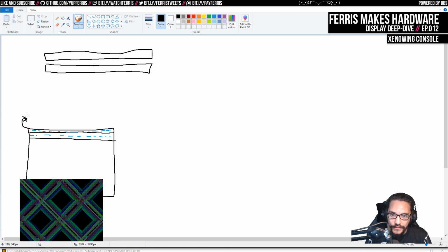And then we read data into this buffer while we start displaying out of this one. But of course, initially it doesn't display out of anything. So then when we reach here, this buffer is filled with a bunch of pixel data. And so then we're going to display out of this buffer twice. We're going to do it once for this scan line, and then a second time for this scan line. And while that's happening, we're going to dispatch a bunch of reads that go into this buffer.